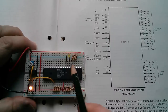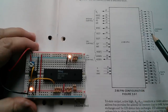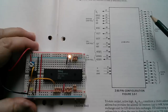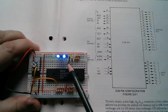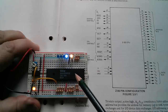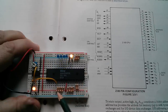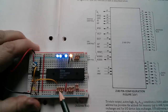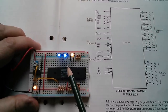Now the CPU is reading data from that pseudo ROM and running completely reliably — the M1 light is flashing on and off at a quarter of the speed of the incoming clock. What we need to look at now are the address lines. I'll put about four LEDs on A0, A1, A2, and A3. We can see a binary counting sequence on those address lines — the CPU thinks it's stepping through the ROM, picking out an instruction from each different location. Actually we're fooling the CPU — giving it the same instruction for every location. The four LEDs look like they're counting up from zero to 15.